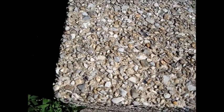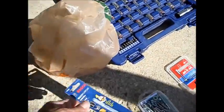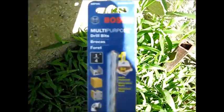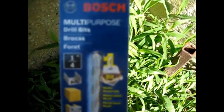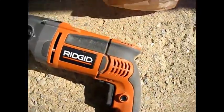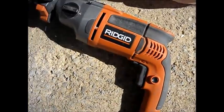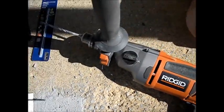For this one I use quarter-inch anchors. We're going to use a quarter-inch Bosch masonry bit. What I like to install with is a Ridgid hammer drill, which is ideal for concrete. The hammer drill vibrates up and down and as you're drilling it'll actually bang into the concrete and assist with the drilling — it's carbide-tipped.